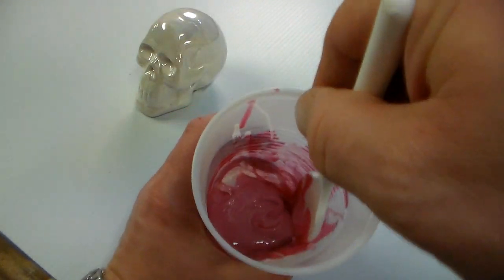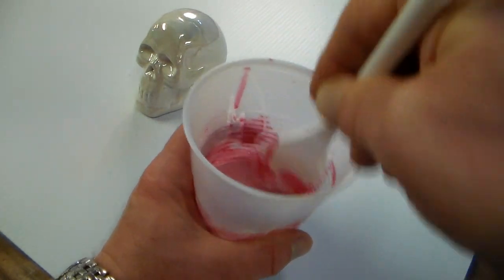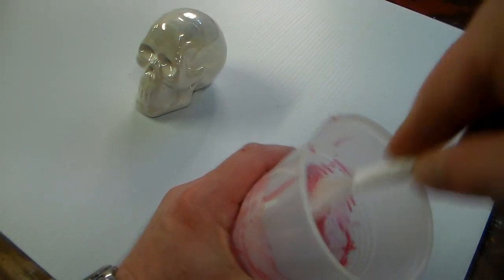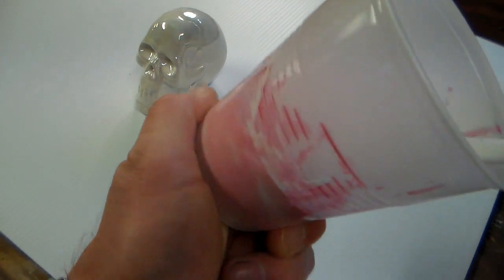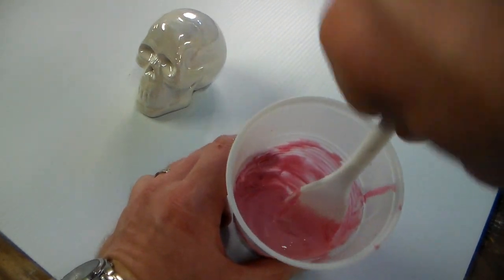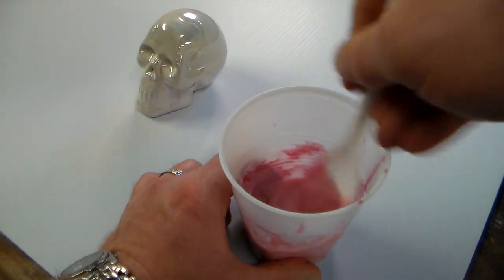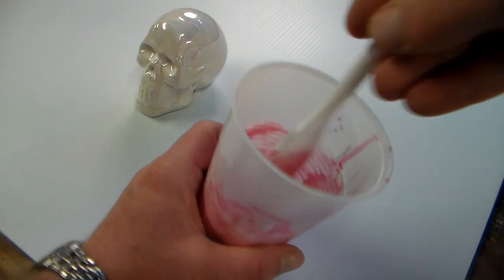Other brands and types of silicone will have different colors of hardener — they might be blue, pink, tannish yellow, or green. Make sure you really scrape the sides. It's also good to use a translucent or clear cup because you can clearly see if there's unmixed product at the bottom. If you're using the standard hardener, you'll have a work time of about 30 to 45 minutes before it starts to kick off. Since I used that accelerated hardener, I've only got about six or seven minutes tops, so it's in my best interest to get this stirred quickly.